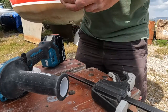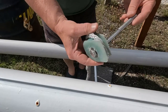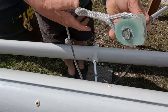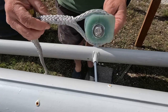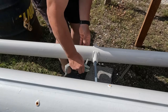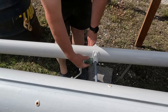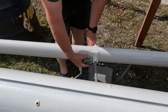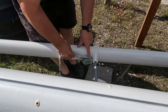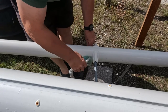Let's go and see how well that fits on the mast. I've got my bolt through and a splice going around it — it's not the right sort of splice, it's not a locking Brummel splice, but it's what I've got handy. Let's see how that fits — put it through the compression tube which is rather loose, which is a bit worrying — and that goes just underneath this riveted-on piece for the shroud. This has got nice clearance — remember this doesn't have a sheave leaf on it so it'll be a little bit bigger, but it's definitely well clear and not touching.